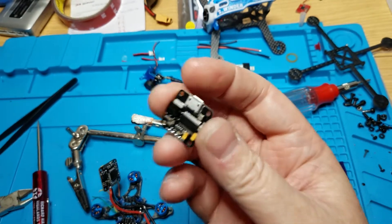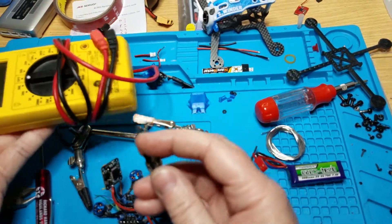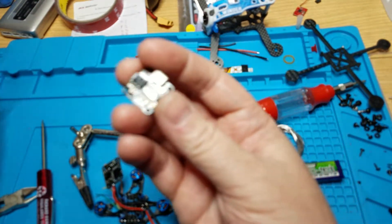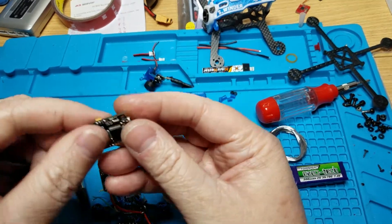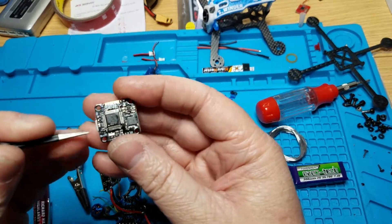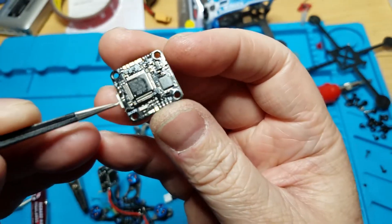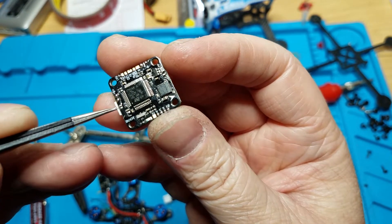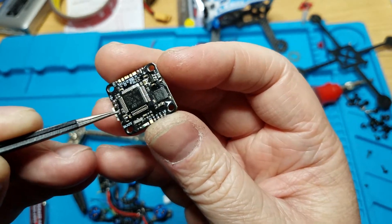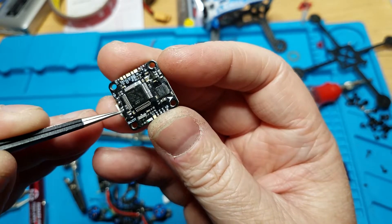It's 2S and 3S only. The way I found that out is I hooked it up to power and ground and checked it with my multimeter. There's a 5-volt pad on here, and there are boot pads right here. For anybody that doesn't know, boot pads are always 3.3 volts, so if you ever need that for Spektrum you can always grab it off the boot pad.